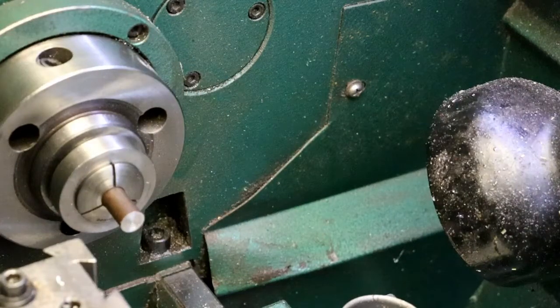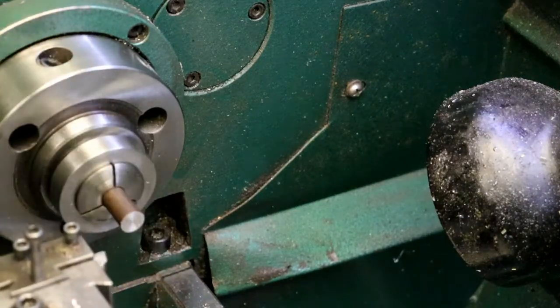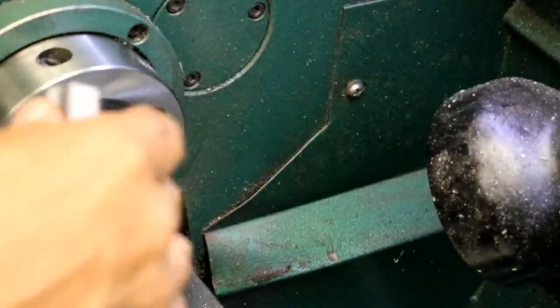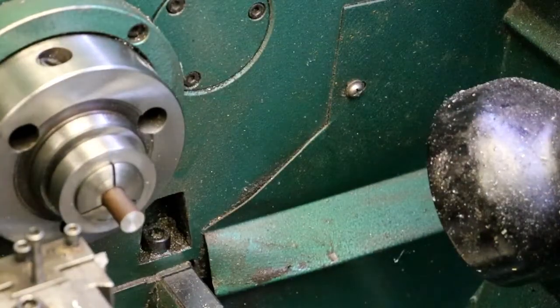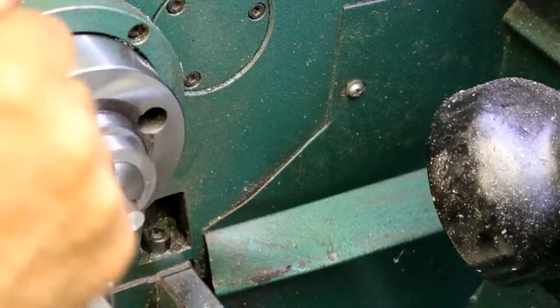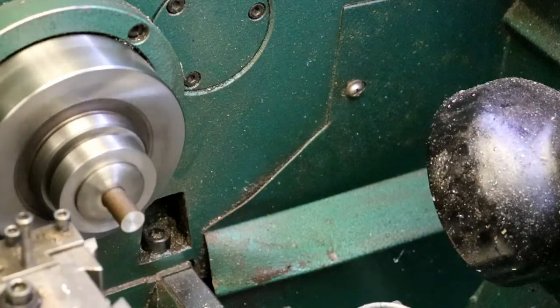Down to 400. It's a 400 OD. It's got to slide into the cylinder, so I'm going to go ahead and get the cylinder over here. Take the cylinder head off here first. It'll have to slide into the cylinder, so I'm going to use that for my checking device.